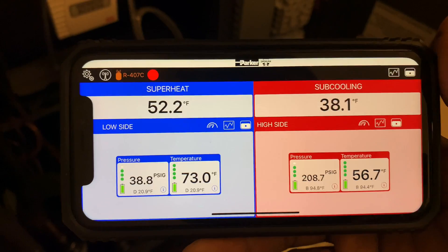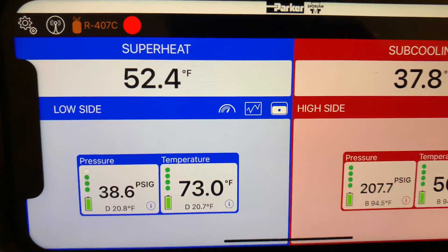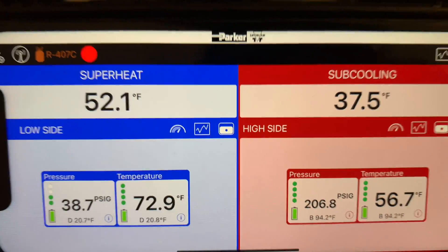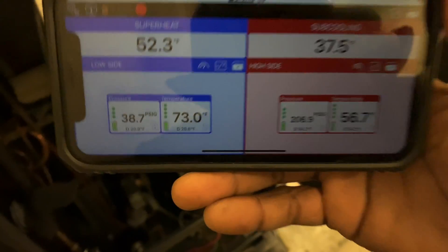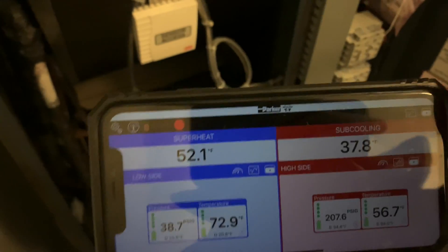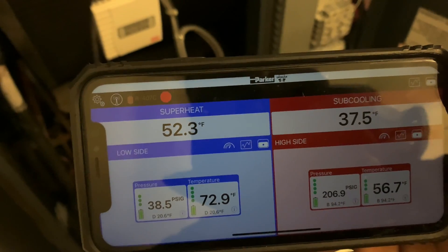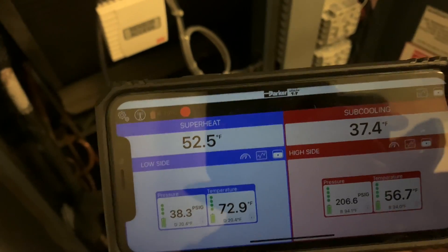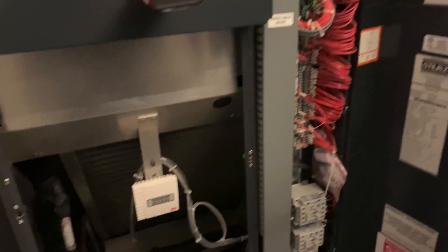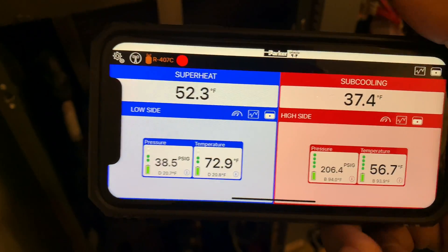The reason for that is when the valve doesn't function properly, it does not open to allow enough refrigerant into the evaporator. Hence you'll have a higher-than-normal superheat — as you can see right here, superheat is 52 degrees. You're also going to have a higher-than-normal subcooling — as you can see right here, subcooling is 37 degrees. The reason is there's not much latent heat change going on on the evaporator side, so your total heat of rejection is much lower, and the condenser is able to reject what's absorbed very easily, giving you a lot of subcooling.